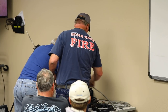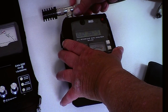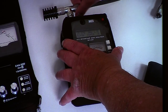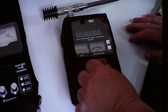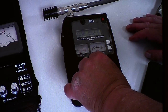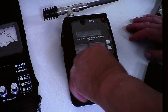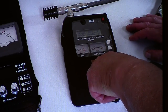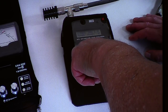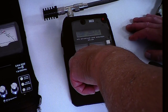So this piece is questionable. We think it's right at 100 feet, plus or minus a couple of inches. So that's a really common length too. So Ryan is going to dip it for us and get it down in the 80 meter band. Down to 80? Yeah, take it down to 80. See where we're at. Okay. Two more seconds below.